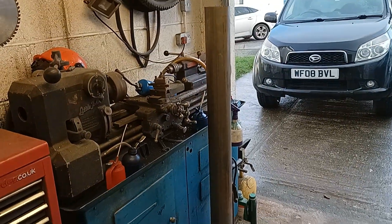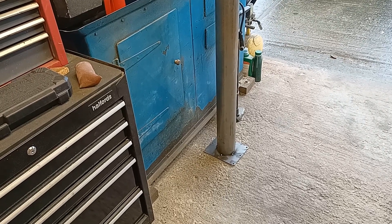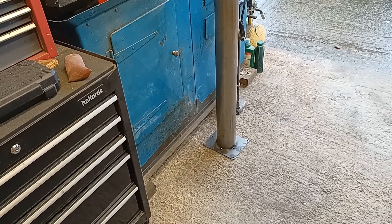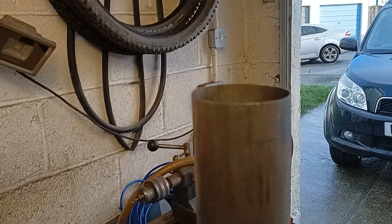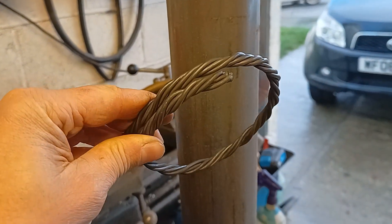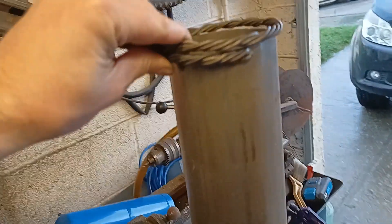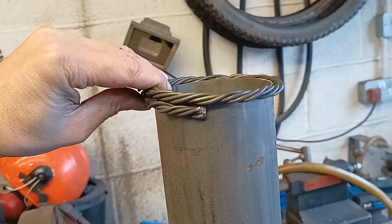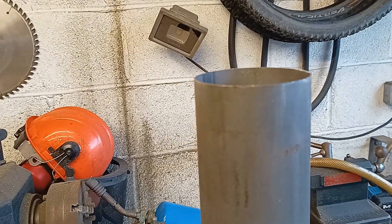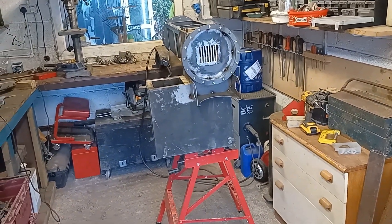So there's our chimney. I've just tacked the bottom one for the moment. What I shall do is bolt that to the Stirling engine — that's all welded together — then I'll weld it together to try and stop it twisting the plate. I found on the top here it's always best to put a ring of some kind along there. What I've actually done is found some wire and twisted it all together — I thought that would make quite a nice top hat to go on there. I should probably TIG weld that on. I've just purchased a new TIG welder — it's only a basic cheap Chinese model, but hopefully that will help me build this.